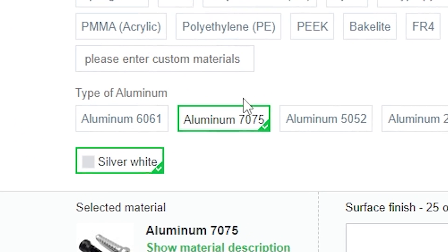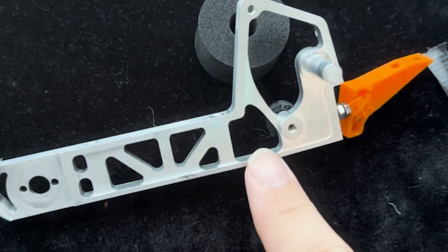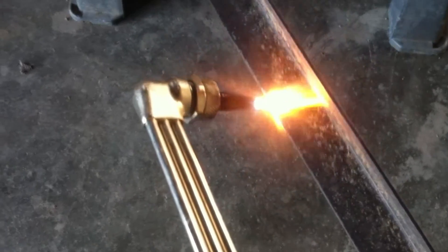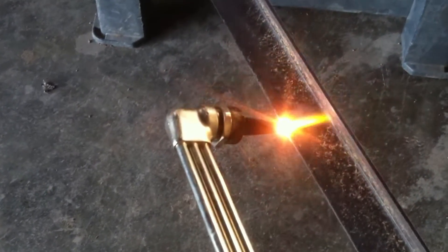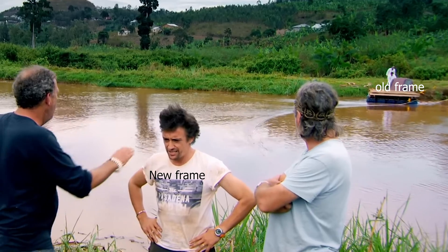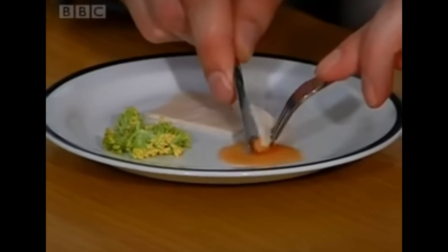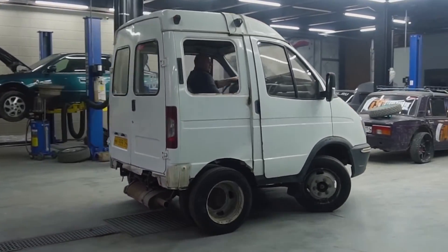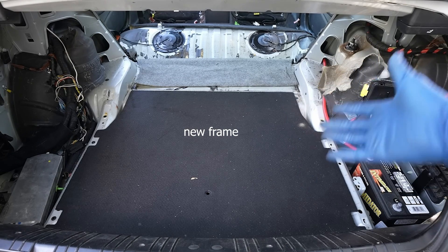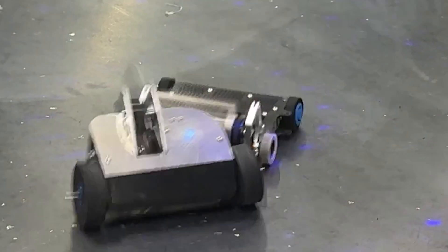The main rails of Vector are made of 7075 aluminum. They are tough, but not tough enough — and that's my fault. You see that part with literally just air in the middle and no material? That's where it would fail. Even if I had foreseen Vector bending his frame like this, I still ended up with a bent frame. I could have used a blowtorch to re-bend it, which would have been the responsible thing to do — so I decided to redesign and make new rails. Even though they were only 35 grams each, they were still too heavy and needed to go on a diet to support the planned upgrades. I shortened the wheelbase slightly, added material to that weak spot, and trimmed down the rails so they only had the bare essentials. The only way they'd be stronger is if they were made of 7075 aluminum again — but how would I get these CNC parts made with my bank account in the negative?